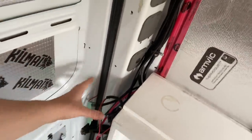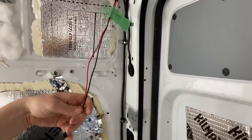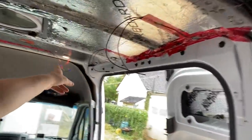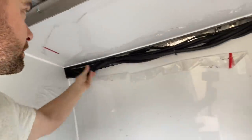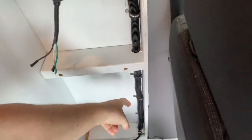There'll be a little one down in this cabinet once he builds all that. These are just Mercedes wires, but he knows what those are. This is for his ceiling fan — he's got a little Scirocco fan that he's going to put up here. And then his lighting wires are already hooked up. So he's going to have two lights back here, two lights right over here, and then two lights up in the front. And of course the shower, he's got wire chase running through there. He's got a wire going down to the heater and there's another one there for the toilet fan vent.